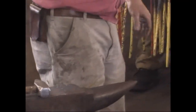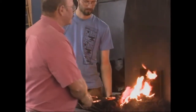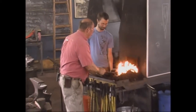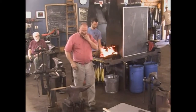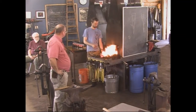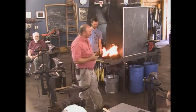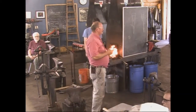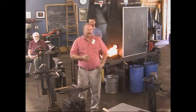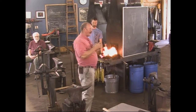So that starts to look more like what we're after. Some people refer to these as bow tie axes because before you fold it up, they sort of look like a bow tie. If you hunt around for information on axes, you can find all sorts of really interesting axes that are nothing more than a forge welding project. The eye is one or two pieces — they're long eyes — and they weld a piece on here, then another piece for the blade, then another piece for the cutting edge. Axes that look impossible to make. If you wrap them, that's not that hard — conceptually it's no different.